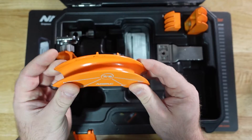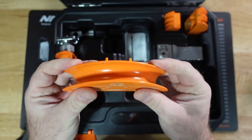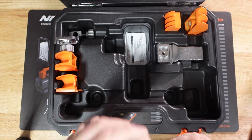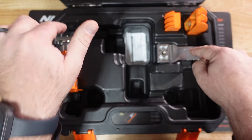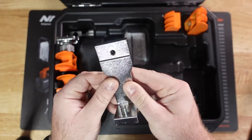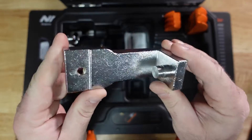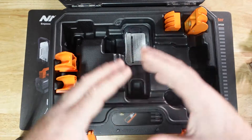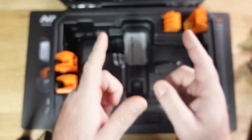We are now left with our orange pieces — these are our mandrels. These are the pieces that will actually seat on the tubing and press upward as it makes its long-radius sweeping bend. Although sold separately, the NT-BRK reverse bending accessory can be purchased and added to your kit. The case already includes the necessary recesses to accommodate both pieces. These are very heavy duty — they will not break, and there will be no doubt in your mind that it is a quality piece of hardware. Now let's assemble our bender, get some copper cut, and get bending.